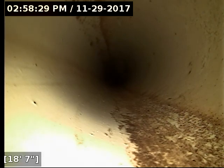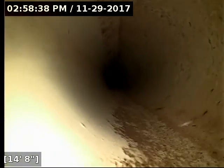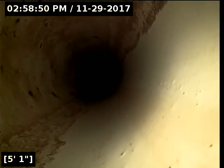I have put some white paint here in the backyard over the area where I'm getting the signal. The depth I'm less certain on — I'm getting about five feet deep when I'm at 26 feet, and when I'm out at 36 feet — 10 feet beyond that point — it's more like 10 feet deep. It's just worth doing a second set of locates there. All the pipe leading up to that point at the offset is in good shape so far.